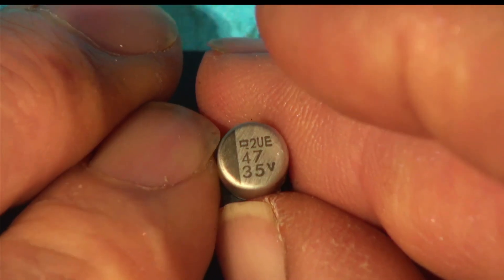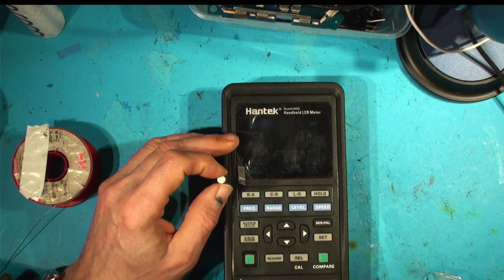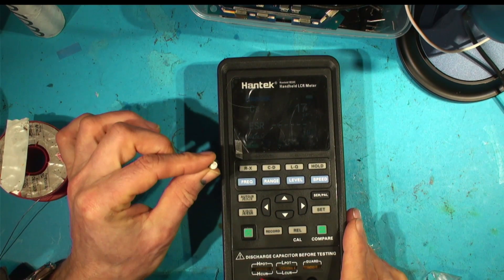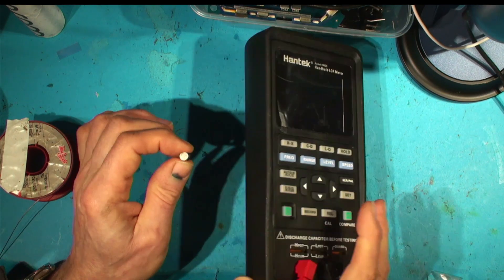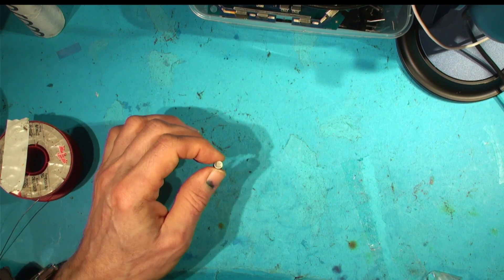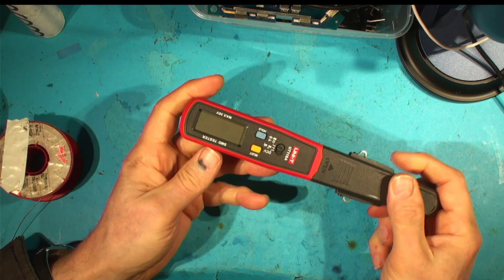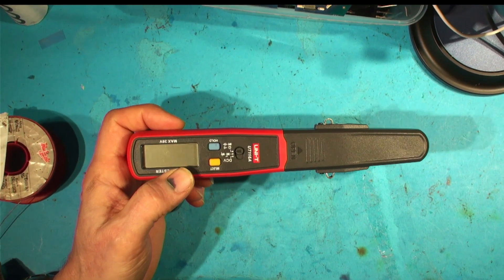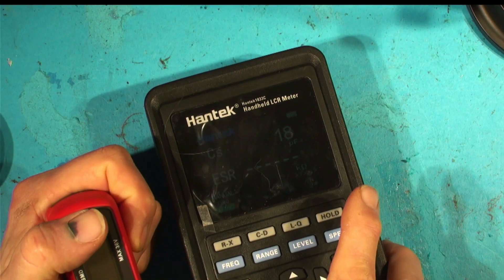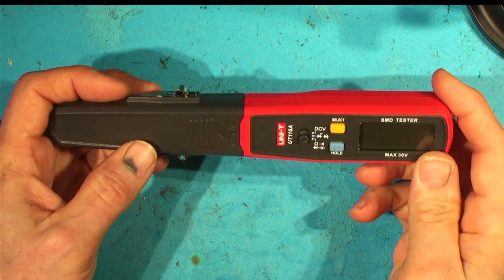If you can check it on the board, check it on the board. You can invest in one of these things - I like the HandTech meter. I'll show you about caps one day - how a cap isn't just a cap. These aluminium electrolytics vary massively in behaviour at reasonable frequencies, say up to 100 kilohertz, and I'll demonstrate that. I might keep making these promises, but I will get some various caps out and have a go with the HandTech.